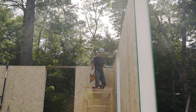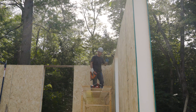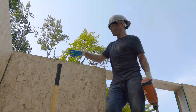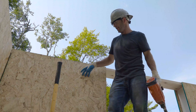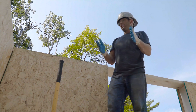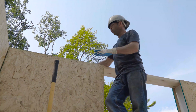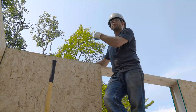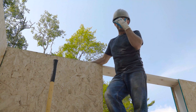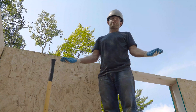If you don't put the nails in right away, the foam pushes the pieces apart — that's the nice thing about the foam. Even if you mess up a little when putting something together, it self-corrects. When I was pricing out different wall systems, I had originally planned a double 2x4 wall with an insulation gap between them — about 16 inches thick — which would give the same R-value. But when I priced out the materials, it was the same price if not more than this system. With this system, I don't have to frame an entire stick-framed house twice or insulate it, and we gained an extra foot of interior space — which we put toward the width of the great room.